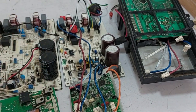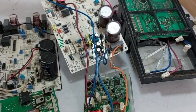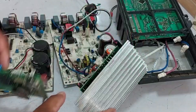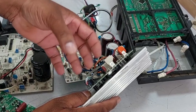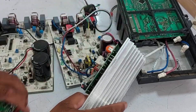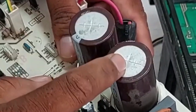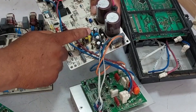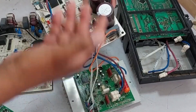There is one common feature I want to point out: these PCBs do not have a separate bridge rectifier. Instead, the bridge rectifier comes from an external connection. The same design is used for both 2-ton and 1.5-ton units — while the external design may look similar, the internal design varies slightly. The power comes from the bridge rectifier and is supplied to the large capacitors, which in turn provide power for the SMPS to operate. We cannot operate this PCB without the IPM PCB, because no power will be supplied without it.